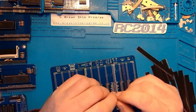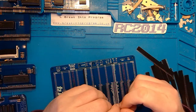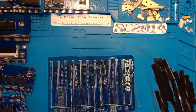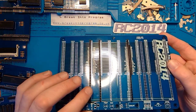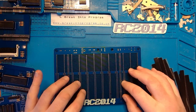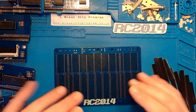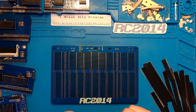What I'm going to do now is stop the video, tack the rest of these in, and I'll see you at the other end - about 30 minutes my time, a couple of seconds your time by magic. Just before I get around to soldering the rest of them, I've noticed it's actually easier to do a couple spaced a distance apart, because when you flip it over you've then got a square surface so the headers level themselves automatically.